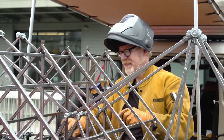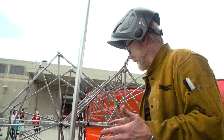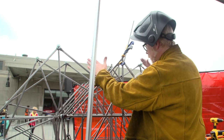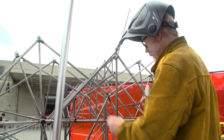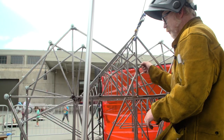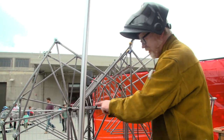One of the key pieces of advice Theo gave me when we met at my cave, that's right, I had him over to lunch at my cave. It was awesome. One of the key pieces of advice he gave me was that this center spine that holds everything in orientation has to be very, very rigid. But that's tricky because it needs a lot of room in the middle for the parts of the Strandbeest to move around. So that rigidity has to come out at the ends, and I've done it with some strut.